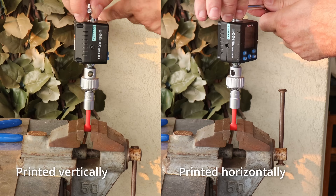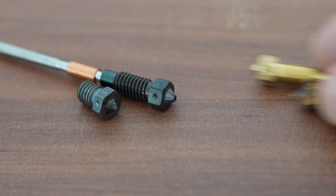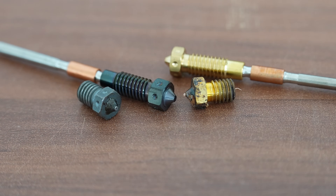If you didn't see that video, watch it first because after that this makes more sense. Now let's talk a little bit about printability. First of all, don't forget that you need some kind of hardened steel nozzle because the regular brass nozzle will wear out quite quickly.